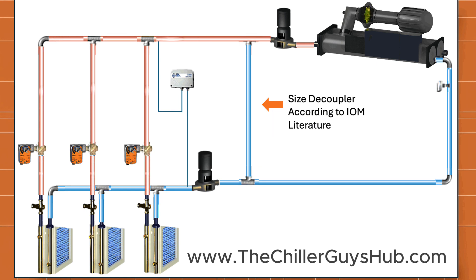The secondary pump's purpose is to maintain chill water flow through the system, and you monitor that with a differential pressure transducer. As chill water valves at the air handlers open and close, they increase and decrease the differential pressure across your system. The BAS picks this up and sends a command to the secondary pump VFD to increase its speed until it reaches your differential pressure set point. The transducer should be piped between supply and return, furthest from the pump — though in practice you'll often find it close to the pump.